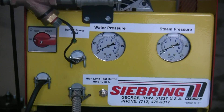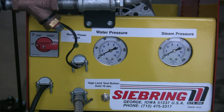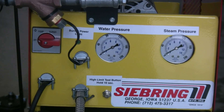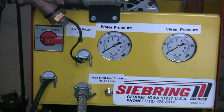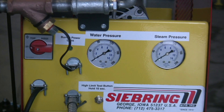The water will continue to come out until it's cold. The pump is designed to put more pressure on the incoming water, because when the water turns to steam it expands about 1,700 times — so there needs to be a pump to push that water from 60 psi up to 200 psi.